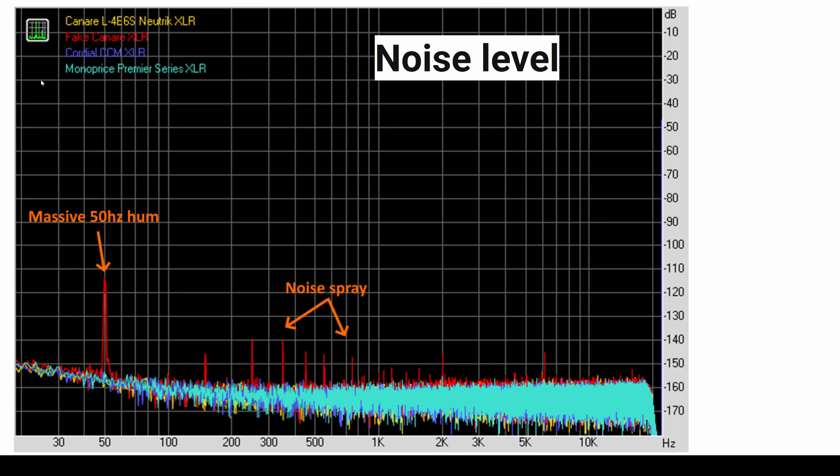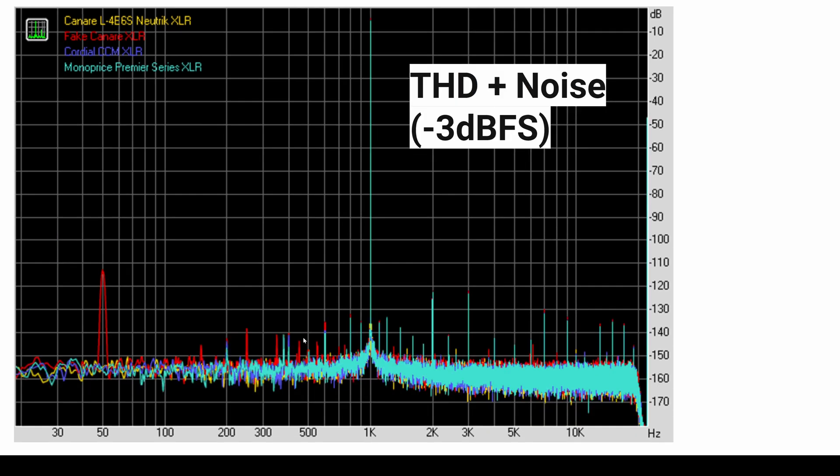That cable with the switched shielding had lots of noise, including some 50 Hz hum — the shielding was failing because the signal was being influenced by the power supply. In a properly shielded cable, you won't have that interference. The $40 cable and my $12 recommendation had the same noise floor. Looking at total harmonic distortion and noise combined, it looks pretty consistent across the board — the biggest problems again come from that miswired cable, not the quote-unquote quality of the microphone cable. And if you look at the Y-axis, we're at minus 160 dB — that is extremely quiet, quieter than almost anything you'd connect to the microphone cable.